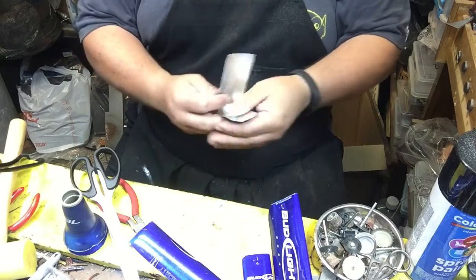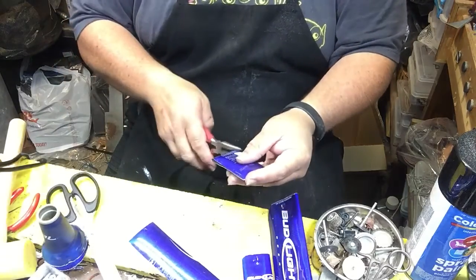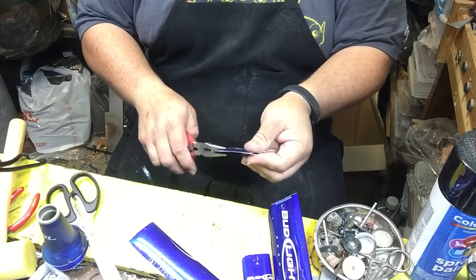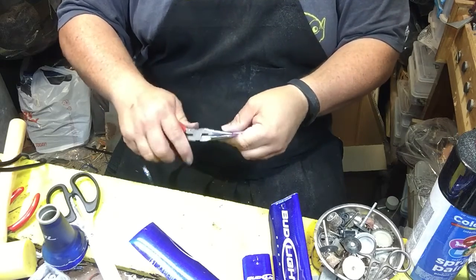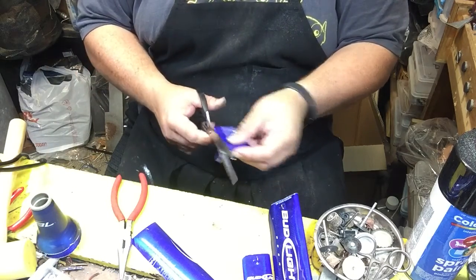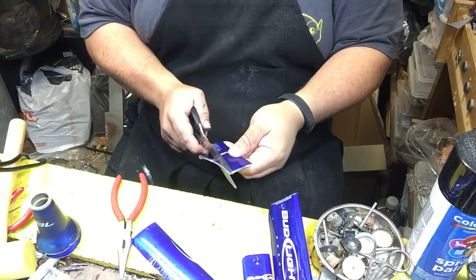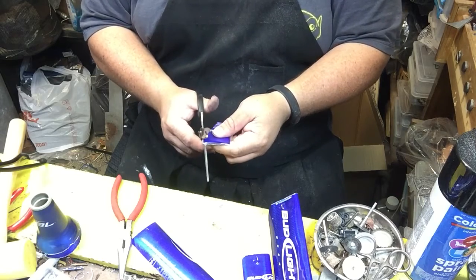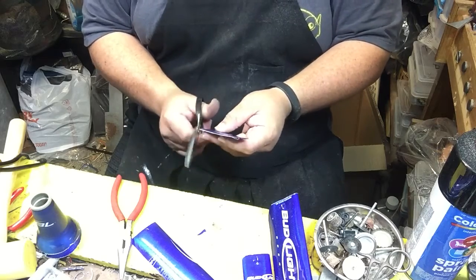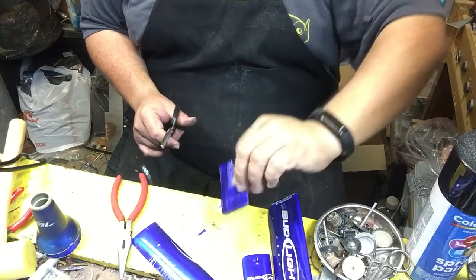This other little piece of aluminum is actually going to become three pieces. I look for the markings like I said. This is going to become the tail — you're basically just cutting it in half or pretty close to it. Once you cut it in half, give it a nice little fold, even up the edges, and shore it up with your pliers so that when you fold it, it comes out more or less straight. We're actually going to put a piece of steel in this to strengthen it up because aluminum is traditionally not a stout metal. You fold it, give yourself a good angle, cut, trim it, and clean it up. Voilà — tail of your airplane.